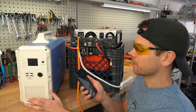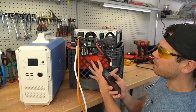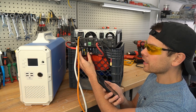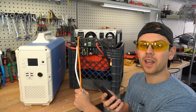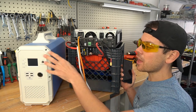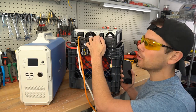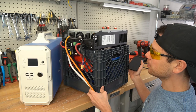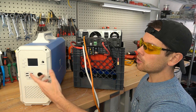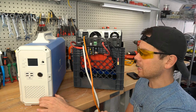Let's do a quick price comparison. The EB240 is $1,600. Our milk crate system's battery and inverter cost $987; add the circuit breaker and cables and it's about $1,050. So this lasts two to three times as long, has 1,000 watt-hours more, and the solar input can handle 102 volts open circuit. The EB240 does have a USB charger and cigarette lighter adapter, but if you want to add those, you could add them to this system for about $20.